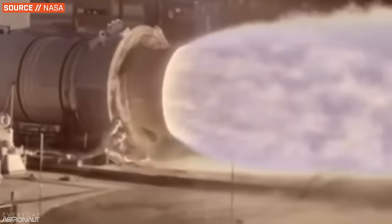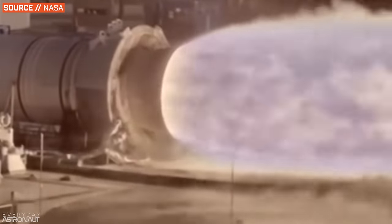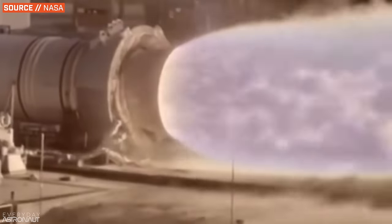It's basically a waterfall of explosives that cascade down from the top of the booster until the entire booster is lit pretty much all at once — stepping up from a small charge to a medium charge to a large charge to booster ignition. It's basically a bomb lit at the top of the booster, or the forward segment, that starts the ignition process. Solid motors are super simple and very reliable because of their easy ignition process, but they can't be shut down and aren't as high-performing as a liquid-fueled rocket engine.